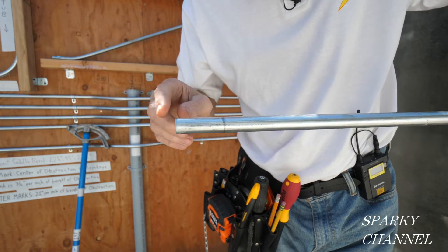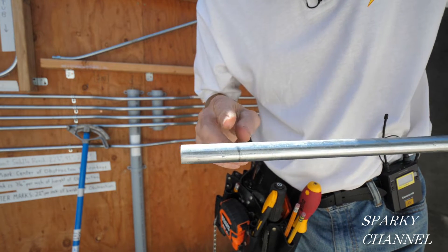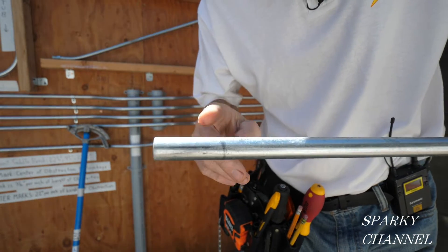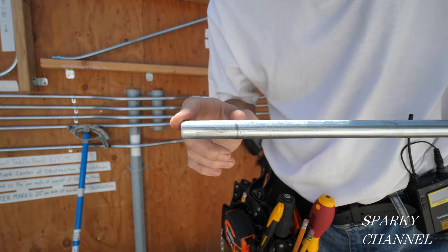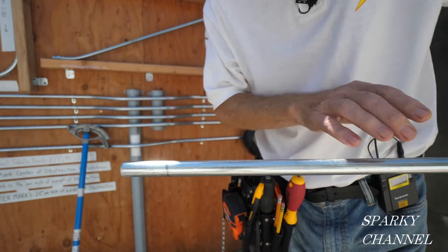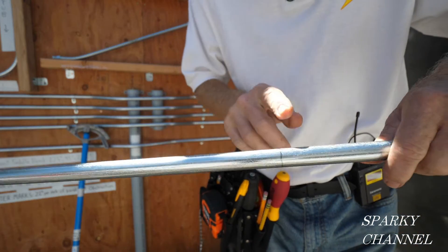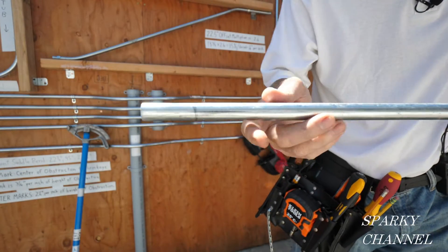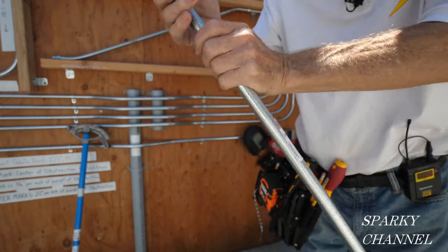I have a piece of conduit here and I measured in two inches. This is an arbitrary amount — it could be 22 or 42 inches — it's just the starting point for your first bend. I needed it nice and short because I have a short space on my wall. From that mark I measured over 35 and 3 quarters inches — that's the distance between the two bends we just calculated.